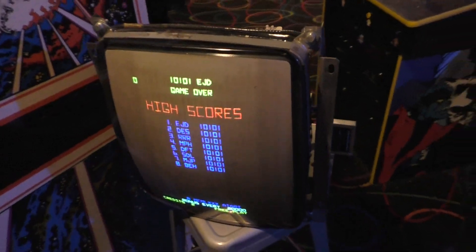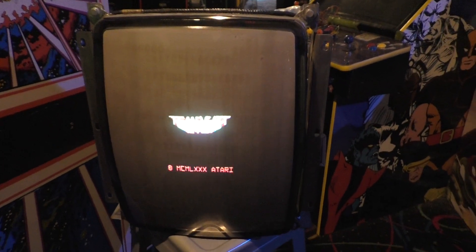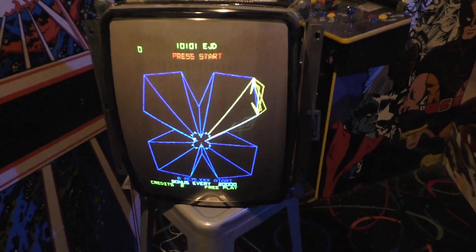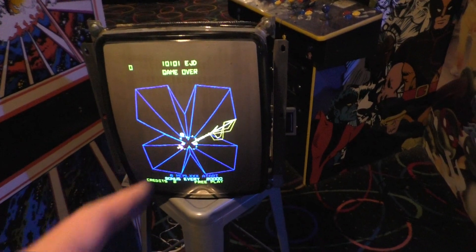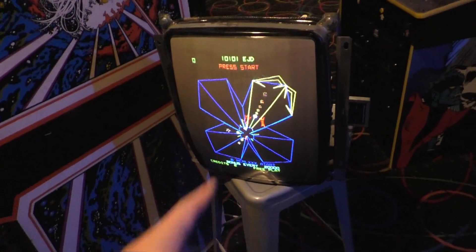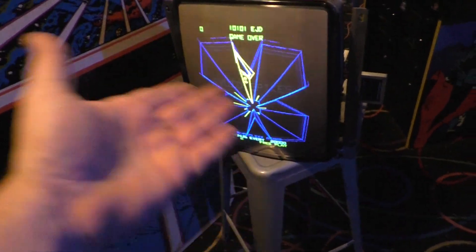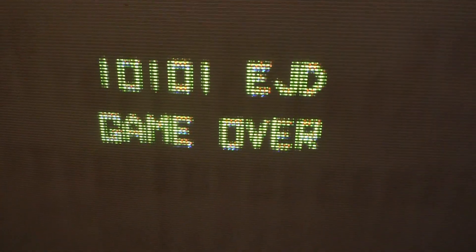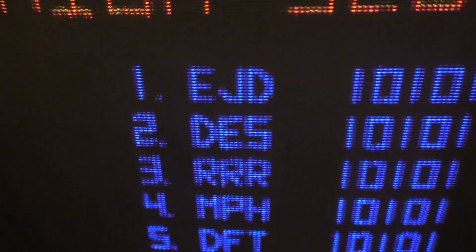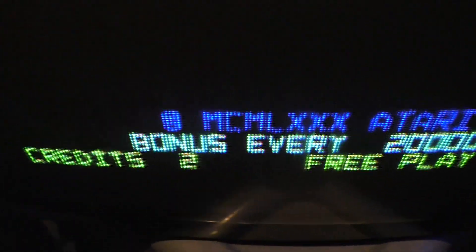It's not perfect by any means. It's being downscaled from the vector to CGA — I think it's 640 by 480. But the true test will be to get it behind the plexi and see what it looks like. In a perfect world, you would just get a VGA 19-inch CRT and throw it in there. But if you don't have that option and you have an extra CGA monitor laying around, you can get the Vector VGA converter and the VGA-to-CGA converter — those two converters and you'd be in business. It's not perfect, but for what it is, it's not bad. Pretty darn sharp, quite honestly. It's actually a lot better than I expected.